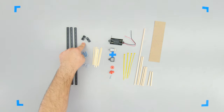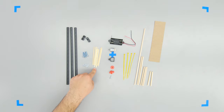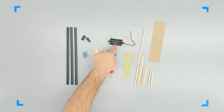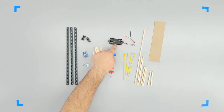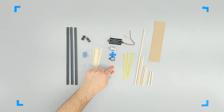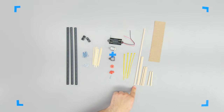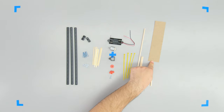To build your boat, you're going to need some stuff, starting with what came in your kit: 3 connector strips, 2 perpendicular blocks, 4 25mm or 1-inch number 10 screws, 4 number 10 nuts, 10 10-centimeter or 4-inch project sticks, 1 AA battery holder with leads and a switch, 1 small 1.5 to 3-volt motor, 1 small 1.5 to 3-volt motor mount, 1 mini-hub cover — it has to be the red one — 1 mini-hub base, which also must be red, 1 mini-hub screw, 4 zip ties, 1 30-centimeter or 12-inch dowel, 2 15-centimeter or 6-inch dowels, 3 10-centimeter or 4-inch dowels, 2 7.5-centimeter or 3-inch dowels, and a piece of chipboard which is 22-centimeters by 5-centimeters or 8.5 by 2 inches.